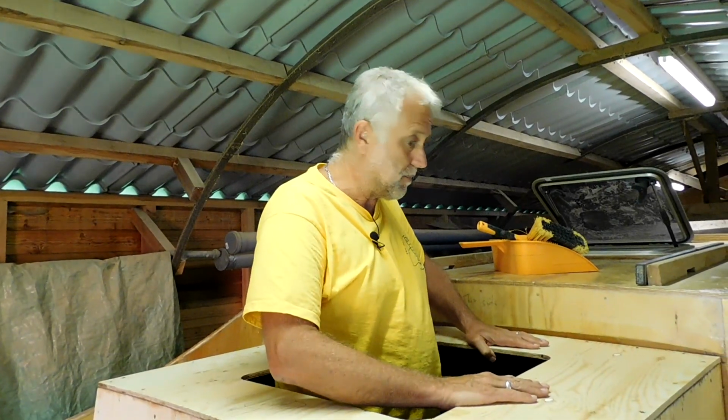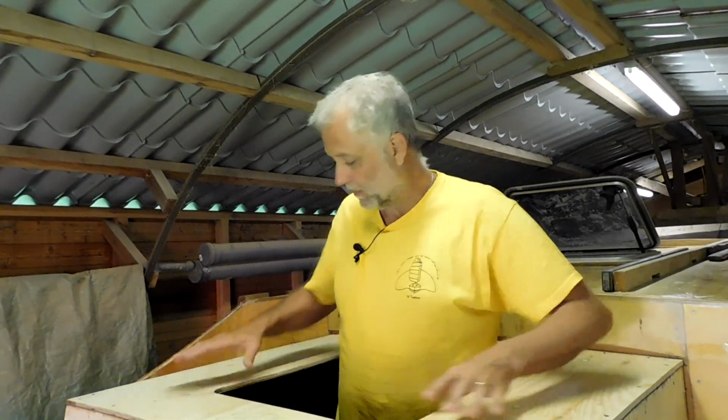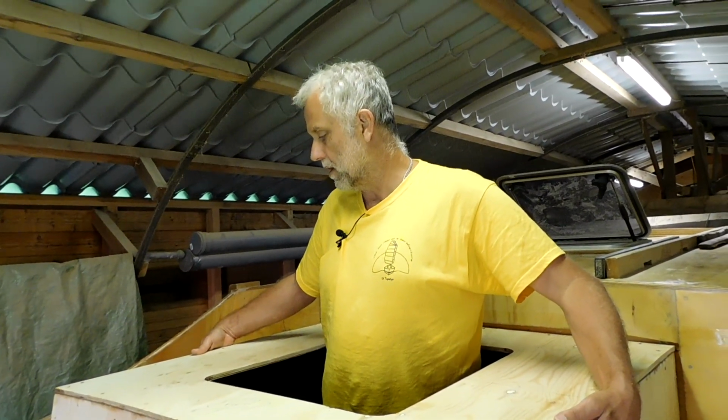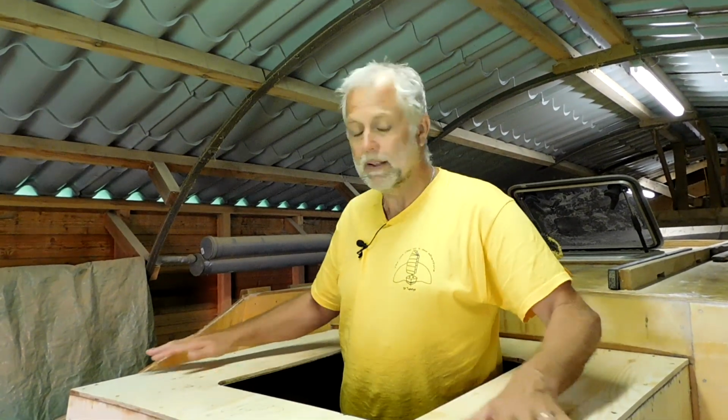The hatch I'm stood in was marked out using the piece that we cut out of the deck for the other hatch, because it would be the same hatch that's in the raised deck. So that's on and in place. Next job will be to get the second layer on all over, and then build up the little plinth to take out the curve, the crown for the hatch fitting.